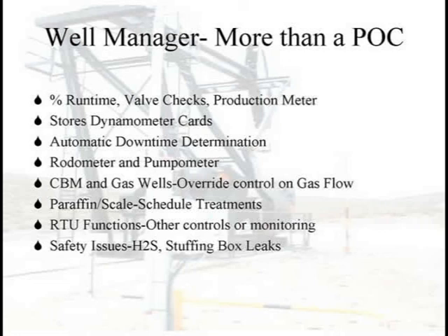A lot of the new controllers have extra inputs and outputs — digital and analog. Digital is just on/off; analog is a stream of data. Maybe you'd like to look at flow line pressure, stuffing box leakage, a vibration switch, or temperature. Maybe it's close to a residence with a fence — you want to hook up a sensor on the gate to see if someone's opened it. All of these things can be connected to these boxes, alarmed, and used to shut wells in and stop things. It's all built around safety.